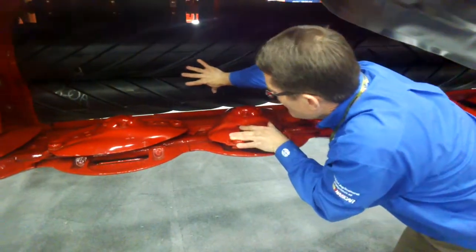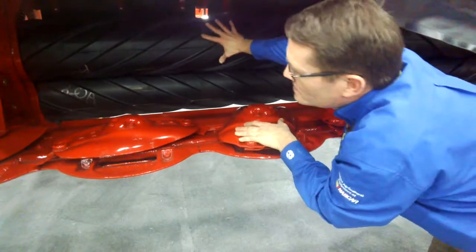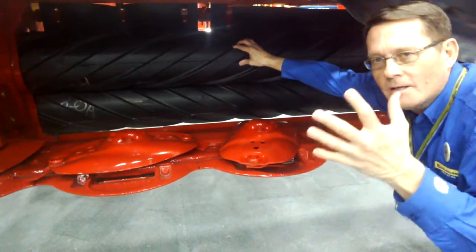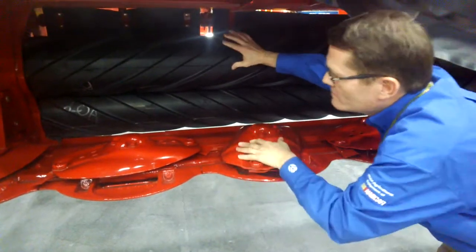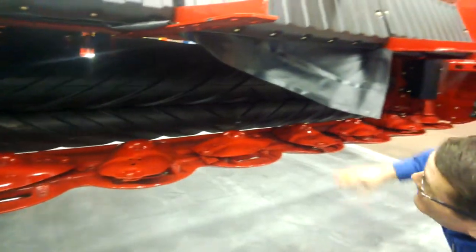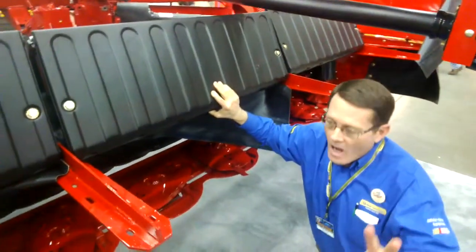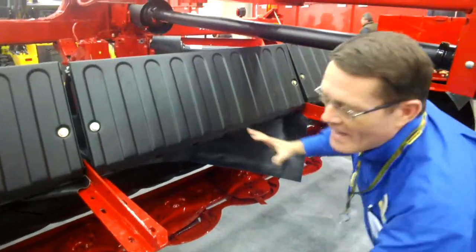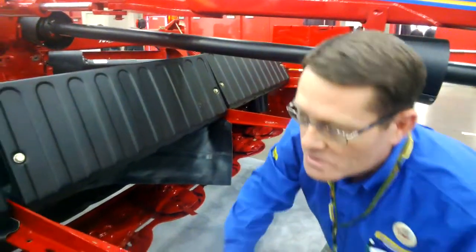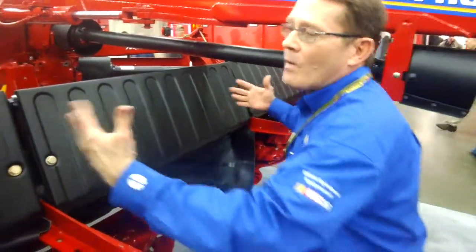This beautiful set of rollers back here — we gave it a name, we're calling this the Wide Dry System. These rollers previously had been 102 inches wide, and now we're giving the 13-foot machine a pair of rollers that are 125 inches, so you have more of the crop that actually gets impacted by the conditioning roll surface. That gives the operator better conditioning of a wider swath.